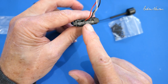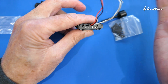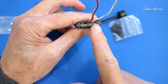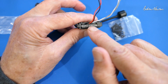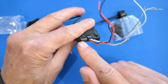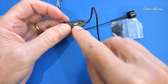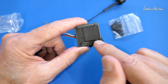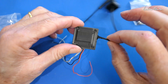You can run these video transmitters with power only. You don't need a flight control board to get it out of low power mode, unlike the DJI O3 cameras and video transmitters. So don't be afraid — if you don't know anything about iNav or ArduPilot or flight control boards, you can just pop it on your plane, power it, set up the power in the goggles and you're good to go. We have the connectorised connection as well as pads if you want to solder directly. And a little push button there for changing channel and binding, and on the other side that's where the USB connector goes in. The 20 by 20 mounting holes here — the bolts bolt in from underneath. And the MIPI cable goes in under here.